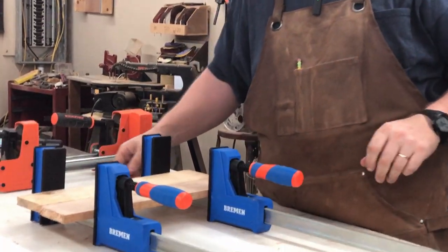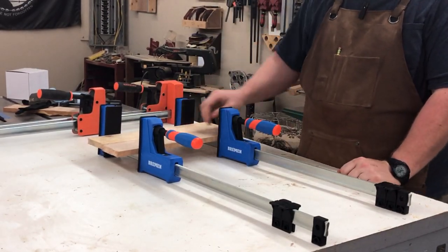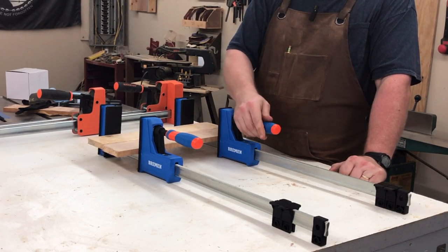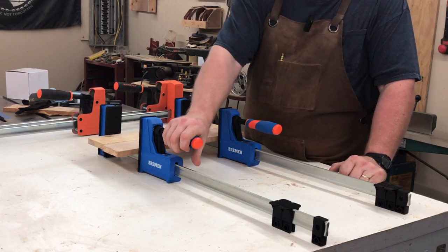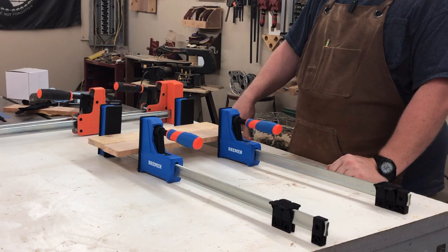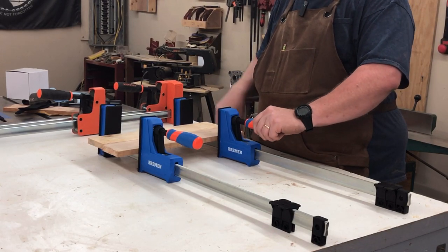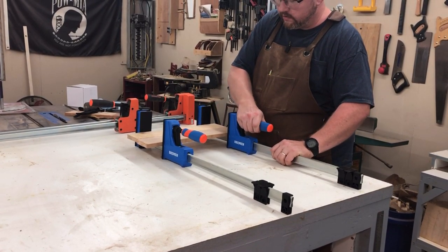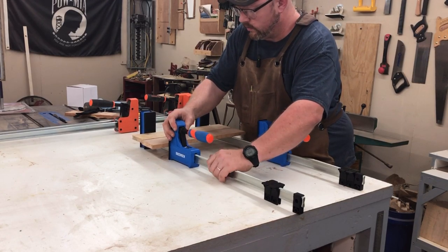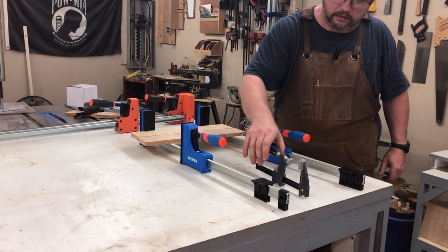If I can pick it up by the wood and it's not bowing or coming apart in the middle, that's a very strong joint. I get a lot of orders for wooden American flags and these will come in handy for that - keeping the little strips even is the hard part. One feature I really like is that these clamps can stand up on their own, whereas an F-style clamp isn't as stable. These are secure when standing on their own, which is a big help.